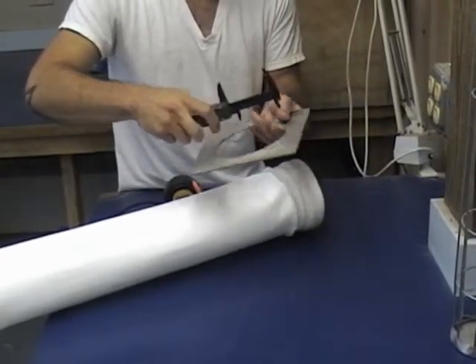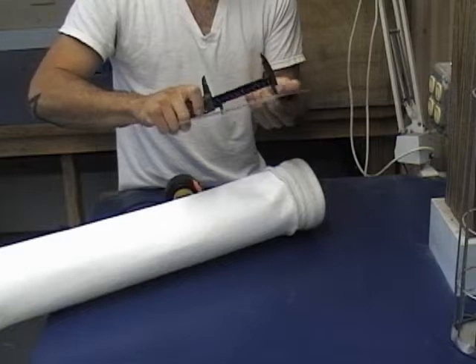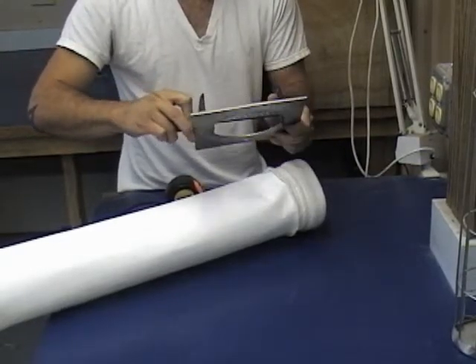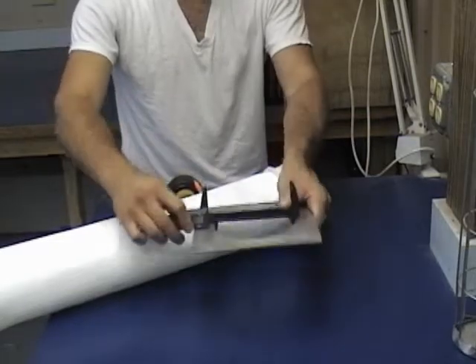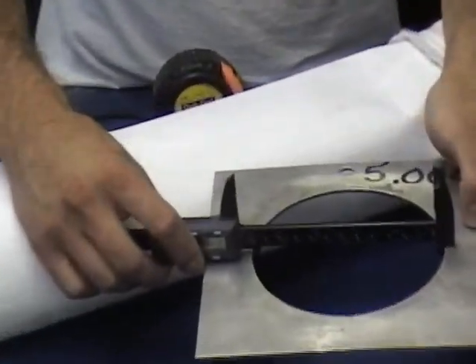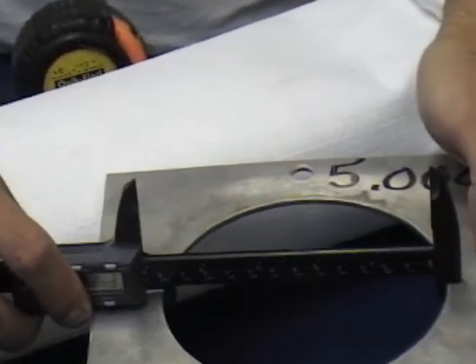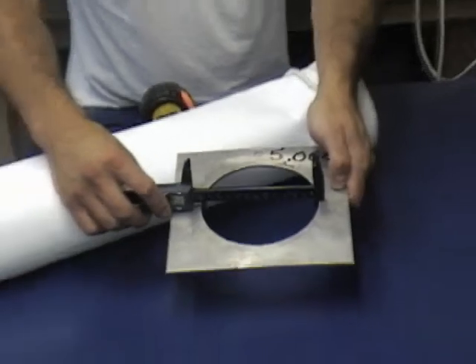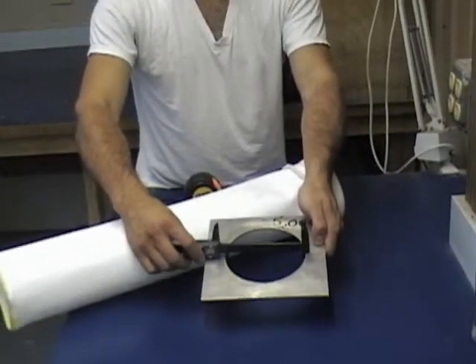This is the way that is prescribed: go up into your bag house, take a set of calipers, and measure across the hole. There are some tolerances usually given by OEMs, so an exact measurement helps an awful lot. Another way is we can possibly send you out some little shorties or dummies to try into your collector, but that takes more time and a lot of times you don't have that.